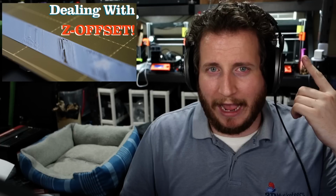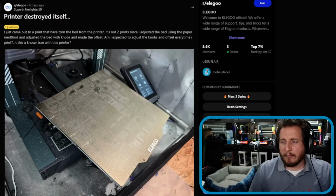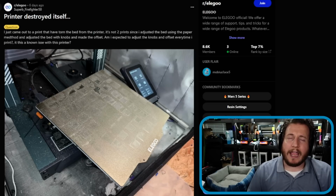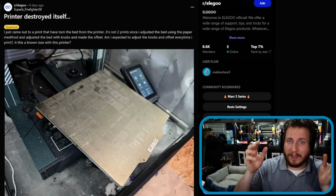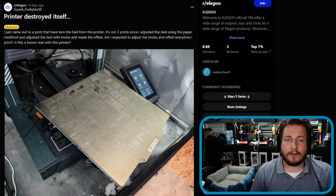As far as what to do here, we had to assess our damages, get replacement parts in if they're not already existing, and let's go through our Z offset and our bed leveling tutorial, which we will card to. But certainly our Z offset is way, way, way too close, right? We normally say if ruffles have ridges, you're too close. There ain't no damn ruffles. You're making your ruffled print bed smooth, and that means you are way too freaking close.